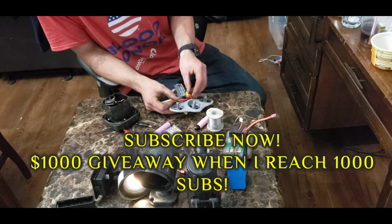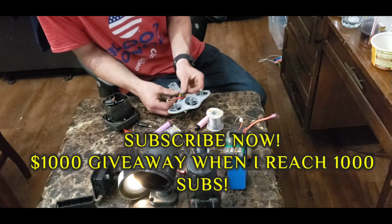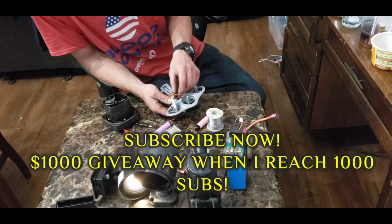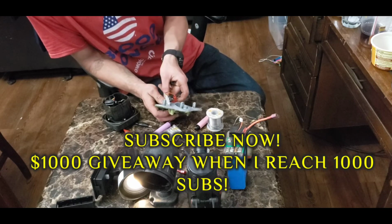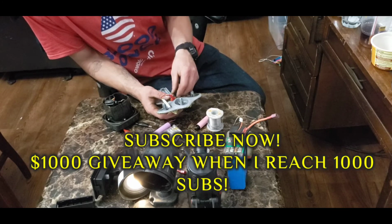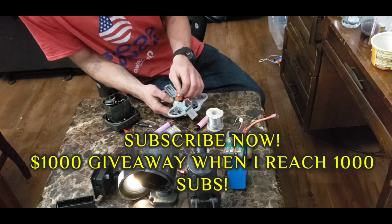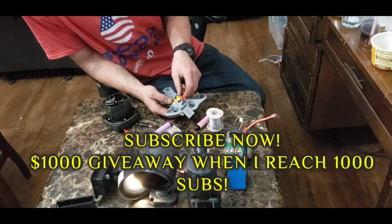The only thing with drones you have to be careful with whenever you're making batteries for them is you have to make sure that the drone is going to be able to pick up the added weight that you may add to it. So if the battery is not very efficient and it has a large weight with minimal watt hours, then it's not one that you would typically want to use for a drone. But these batteries actually pack a lot of punch for their size and weight, so I would highly recommend using these for a drone.